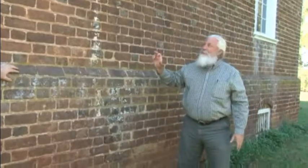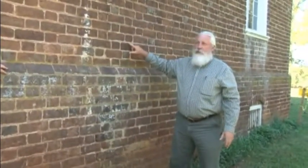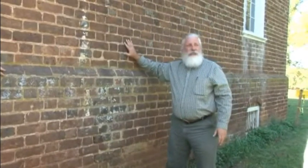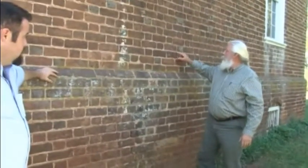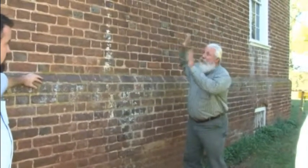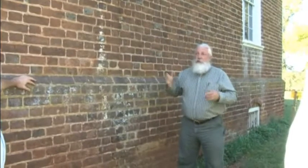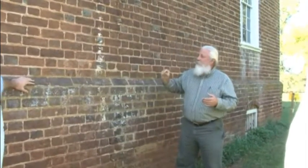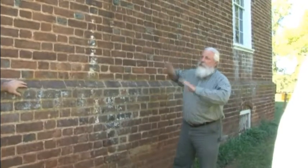To remember on historic buildings or any building — these bricks are three and a half inches deep. If all of these joints had lost a half an inch in and it were still solid, it's no big deal. It's lovely to see the joinery and the color and the face, but structurally, a half inch of loss would make no difference whatsoever. So when people see a little bit of loss and they get excited and maybe redo entire walls...